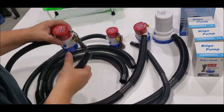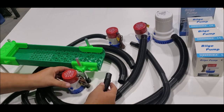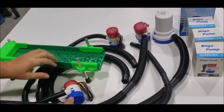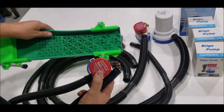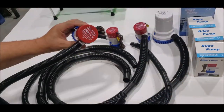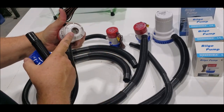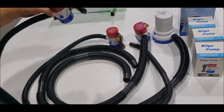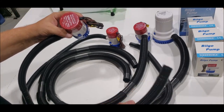These pumps are really weak on vertical lift. If you put this thing in a tub at the same level with three foot of hose, you get lots of pressure. Drop it down three foot, a lot less pressure. Drop it down five foot, this 500 pump probably wouldn't be enough to run this because it can't push water up five foot — it's an open, non-pressurized, non-positive displacement pump. This is a bilge pump. I know I'm using technical terms, but we're just trying to help you select the right pump.